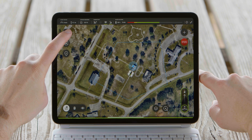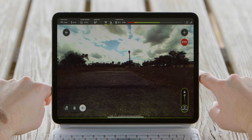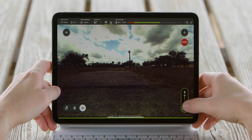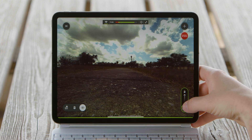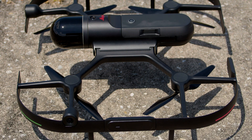After completing your pre-flight checks, you are now ready for flight. From the live view screen, we are going to first check that we have GPS connectivity, full WiFi connection, and if you are using LTE, that you have a full connection there as well. Like the rest of the BLK2Fly, the takeoff procedure is very intuitive. To arm the drone, move the slider at the bottom right of the live view screen up and then press and hold the green BLK2Fly takeoff icon.